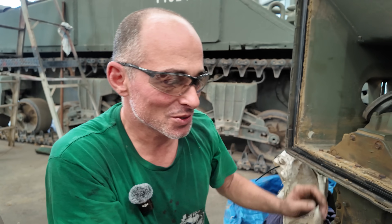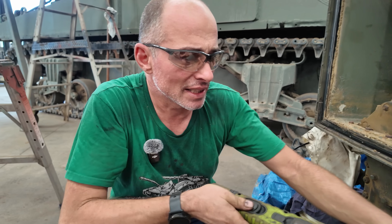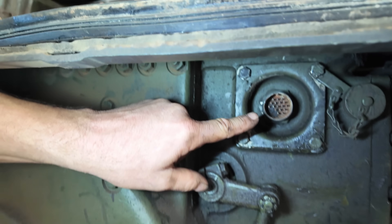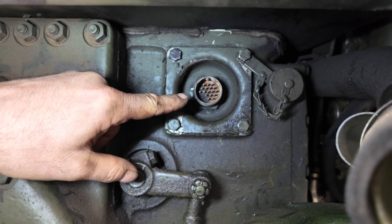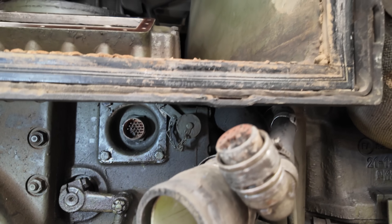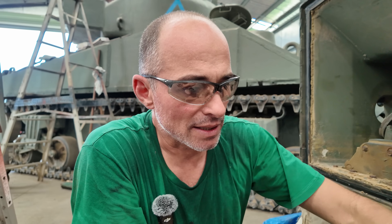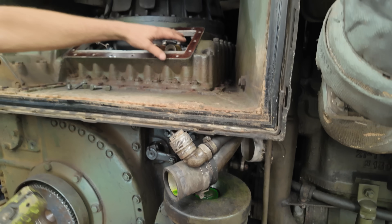As you can see, the connector itself had water in it which has caused a short circuit at some point and blown the solenoid. I'm actually quite happy we found that, because if we'd gone to all the trouble of putting everything back together again, we could have blown up our new solenoids which had been purchased at great cost and took a large amount of time to get — which wouldn't have been ideal. Not only is this part of the connector damaged, but it's made a real mess of the bulkhead connector in here. It's actually broken some of the pins off. So this connector is toast, and that's toast as well. So we're on plan B — plan A was just replacing the solenoids. Plan B is to source a replacement entire loom and also the wiring which goes inside the transmission. Plan C is for me to learn how to rewire mil-spec connectors and order the replacement parts and try to do the repair myself.